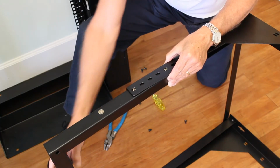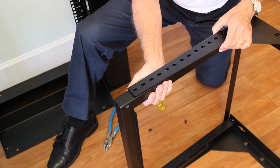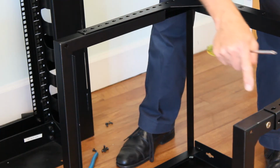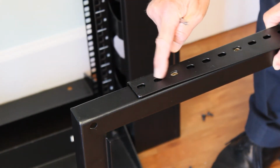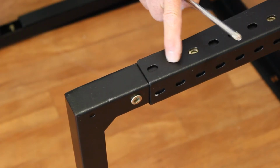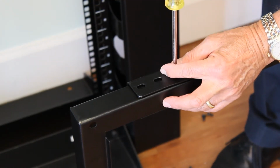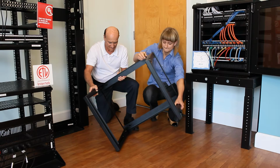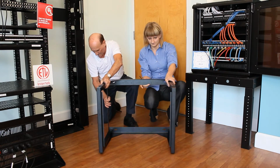The depth is adjustable from 18-inch and up to 26. Don't worry. You can always readjust later. Once you determine the required depth, align the two together and secure the position using some more M6 screws. Remember, don't screw them too tightly, as you may want to readjust later.